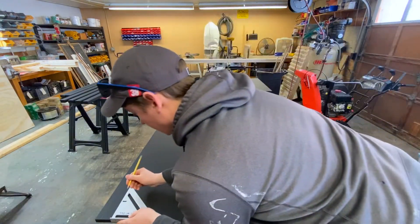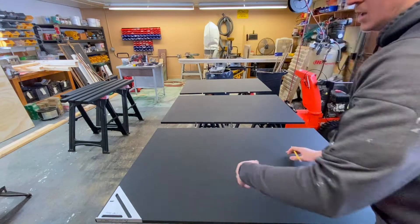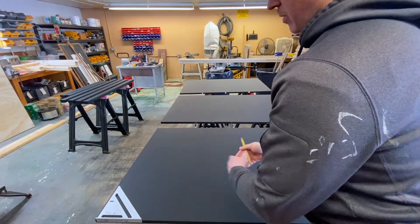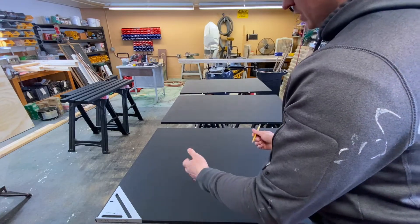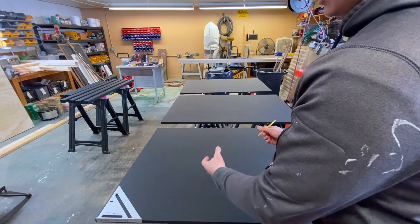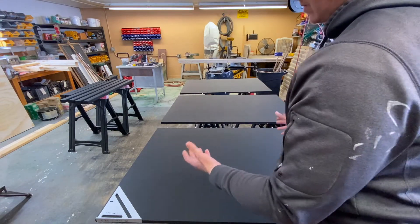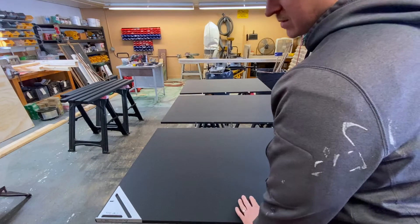So what I am doing now is I am marking — this is the back side of the board. I'm going around and marking three-quarters of an inch in so I can have all my screws lined up right in the center of all the boards for the border. All I'm going to do is pre-drill these with a recess bit so I have a nice flush back for the screws. However, I'm gonna have window hinges on here, so the flushness isn't a huge thing, but if somebody runs their hand across the bottom they're not going to catch themselves on the screw.